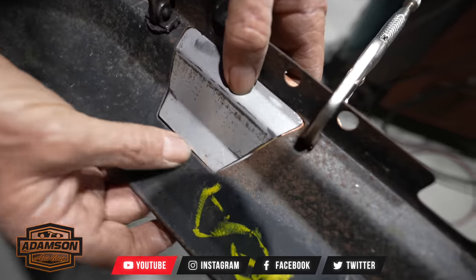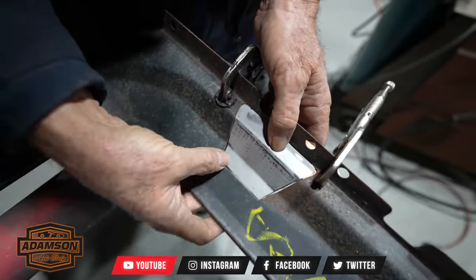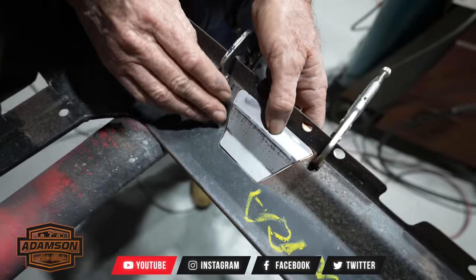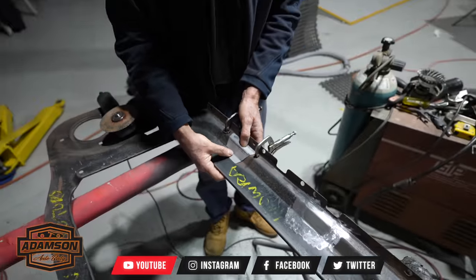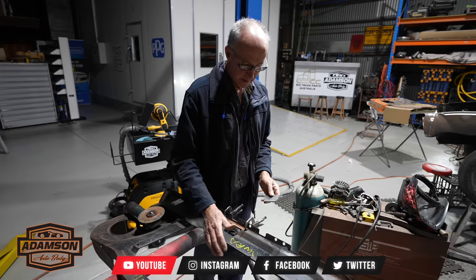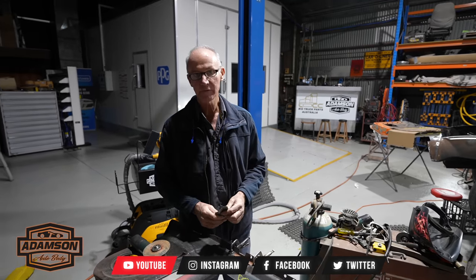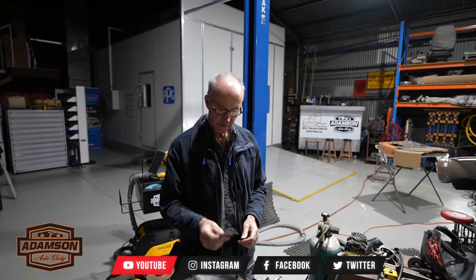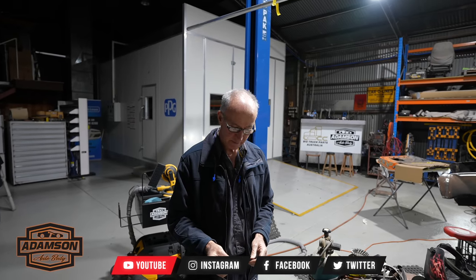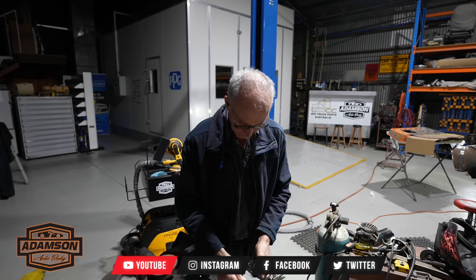Now I'll dress the edges of that up. Same on this rad support. And I'll just spot it in a couple of places. Carefully, then just tack it all in as I go. And dress it up, but what I'll do is once that's done, we'll blast all that, epoxy prime it, and then we can start to fit it up to the car. But yeah, just use the zinc coated stuff as we do, and away we go again, another patch panel. Yeah, nice.